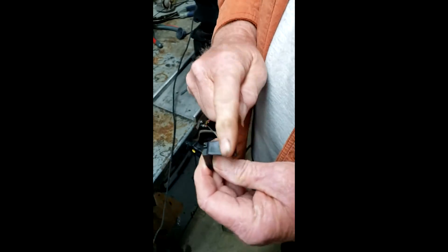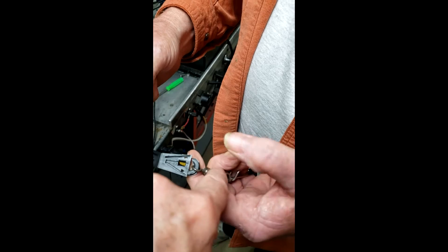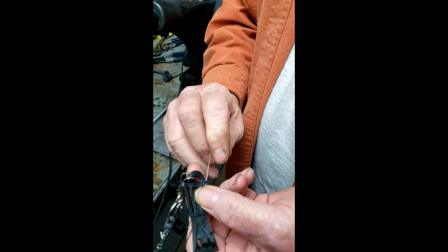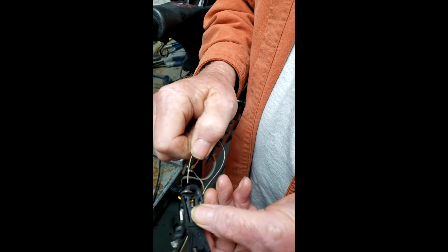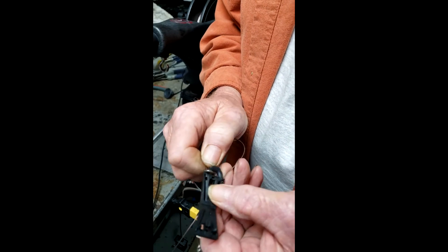On these terminators, first thing you have to do is put the hook on it. Then you're going to start on the outside, coming in toward the hook on the closed side. Then take your cable and run it around toward the open side into the little hole, and slide it all the way in until it comes back out in the middle — we'll show you once he gets it in there.